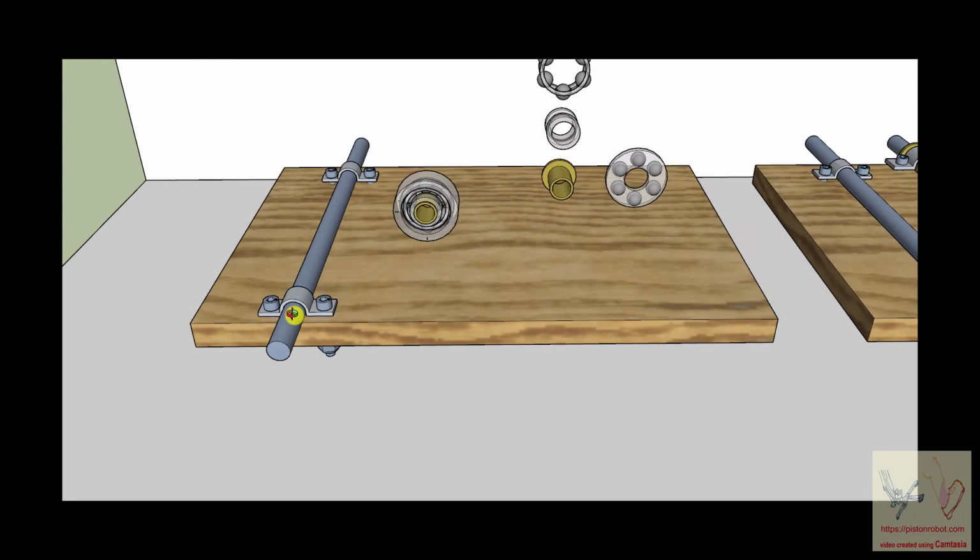And an issue associated with bearings includes the particulars of your bearing. How big is it? How much force is it going to be controlling? What is the maximum amount of force that you want it to be able to control just in case? Is it made of exotic materials? Is it exposed to a harsh, chemically reactive environment? Is this a life safety bearing where human beings stay alive if it works? Is this a bearing that is put up in outer space where if it fails, it's a catastrophe because it's not really fixable? What are the tolerances for the bearing?